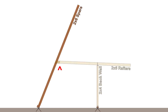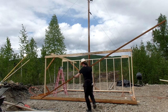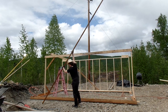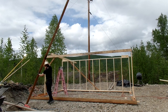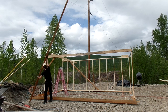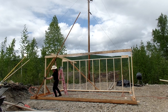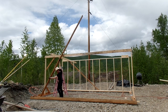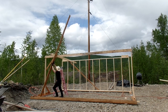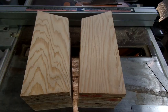I can't do this in one step, so the idea is we're going to put in a temporary wall and then we can lean the spars up there. The 2x6 spars are 20 feet long and they only weigh 40 or 50 pounds, but they're just unwieldy - a 20-foot long board is definitely a tricky thing to handle. You can see that temporary wall is pretty wobbly; actually this whole thing is pretty wobbly until I get it all locked in together. But it was definitely possible to set the things in.